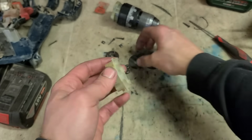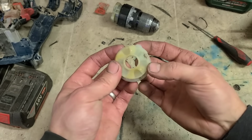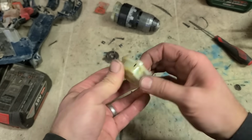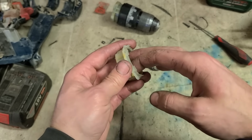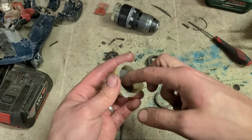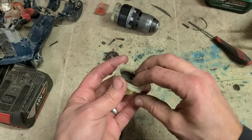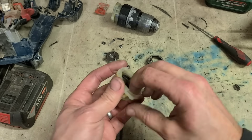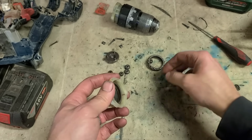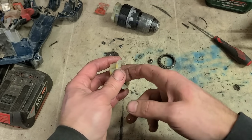If that pushes down, this washer can then move around behind it, or move with it around. You can actually snag. So this here can't actually rotate, it's locked on. The washer can. I can just spin. So if this comes out and the washer moves, then it actually locks it out, so it can't go down. So this packs the whole thing out. So this gear selector can't actually move back in. So that could be the problem.